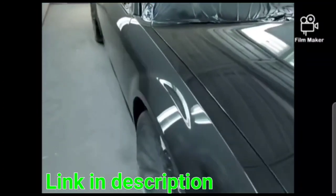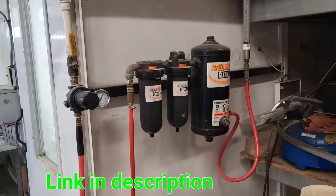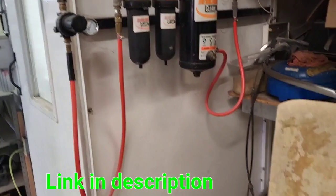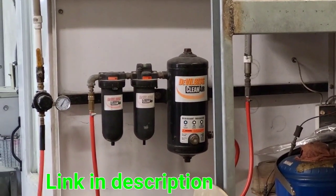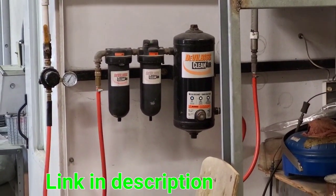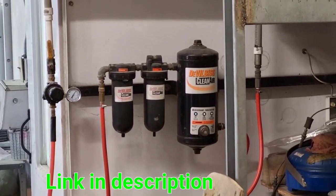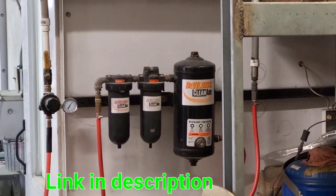The third phase has low-dusting desiccant, which removes all water from the lines. It also allows 25 CFMs of airflow, so there's no restriction. There's also a sight glass on the third, showing you when the desiccants need changed. I hope this video helped and I highly recommend it.